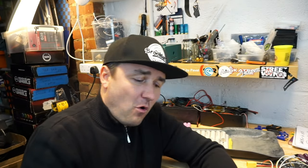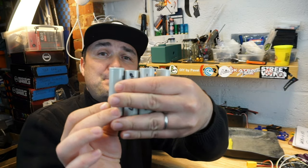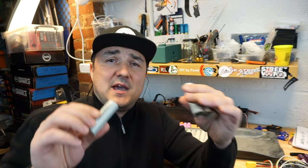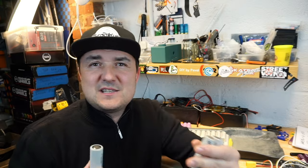So my 4P will give me 4 times 4200. This is 16,800 milliamp. So let's round it up, 16 amp hours. That is really good. That's exactly what I need. That's probably gonna give me about, I would say 15 to 20 miles, depending on how you ride, okay? And that's plenty, because after the first 10 miles or 12 miles, my rear leg goes numb.